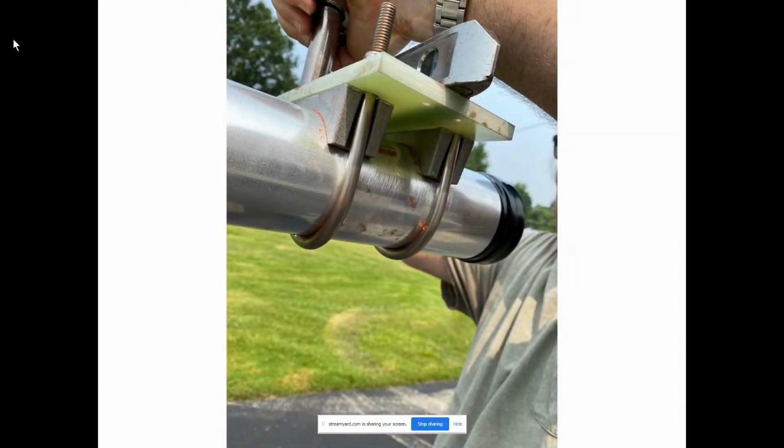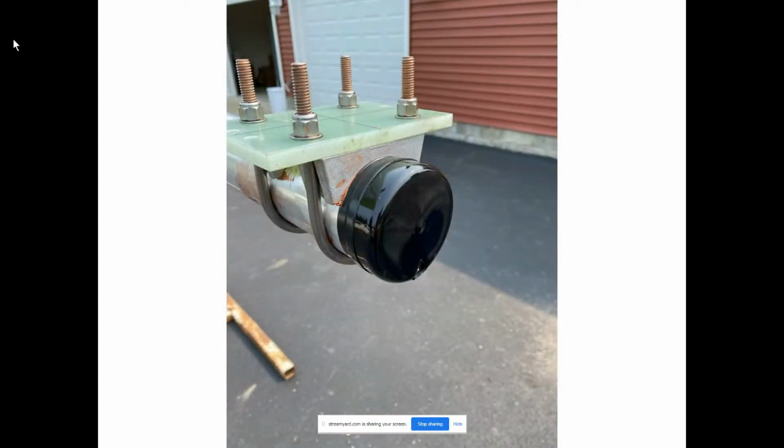Here's another good shot of, notice how the aluminum tubing, the boom there, and that's DX Engineering 3-inch boom, has been cleaned and taking the aluminum oxide off. And then there's SS30 in there too. Boy, those 300B saddle clamps, very strong, and of course very popular at DX Engineering. You can see the level on there, and Timmy, from the tower company, doing the work tightening things down. And this is the end of the boom. This is actually the reflector, and notice there's just places for 2 of the smaller U-bolts in there. And so this is the end cap.